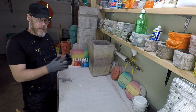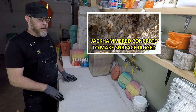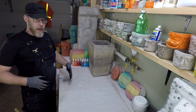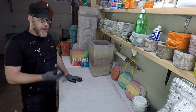Most commonly the application is that the existing stuff is too smooth. You could dimple it or scarify it, kind of jackhammer up the surface and make it jagged and irregular. You could pin it and dowel it with steel. There's a lot of stuff you can do, but commonly if you have an existing surface which is too smooth, you apply a scratch coat.